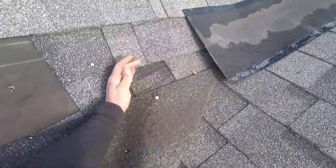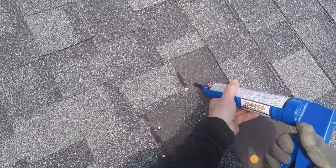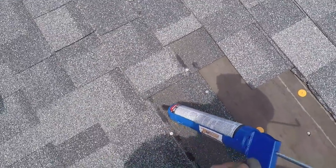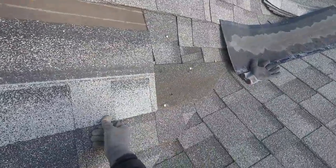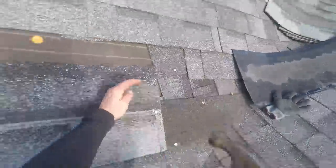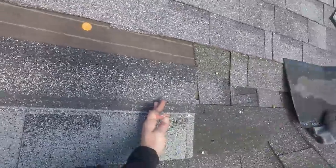These ones look fine here. Now I'm going to nail roughly six inches away from the seam — you want to leave space for that shingle. The seam's going to be here, so leave space. I need to caulk these two nails also because they're extremely close to the seam. I don't like that — I hate it as a matter of fact. And with valleys, you don't want to nail close to that valley center, not within probably six to eight inches.